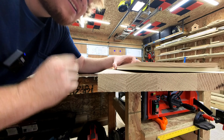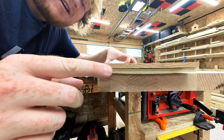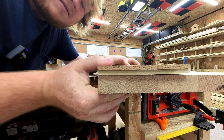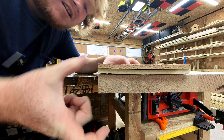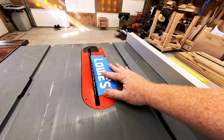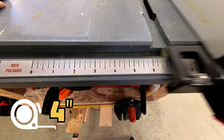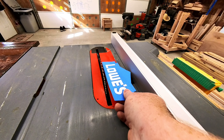I have this solid oak stair tread that I'm going to use because it's about an inch thick. Then I went ahead and picked up a piece of poplar and another piece of that red oak, and I'm just going to layer them and then mirror this onto the bottom to give it a little bit of thickness. I set the table saw to four inches — since the boards will shift and slide around during glue-up, I left about a half inch of oopsie room to trim off later.